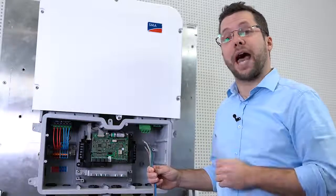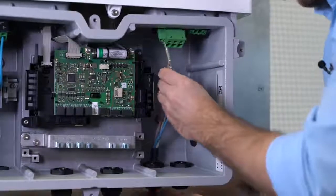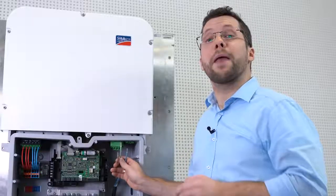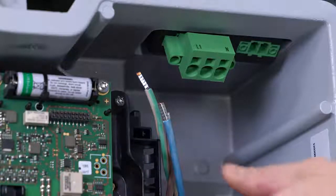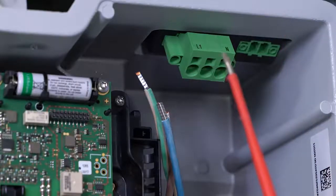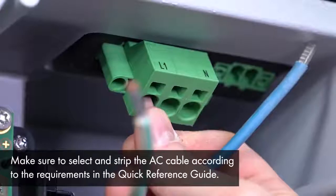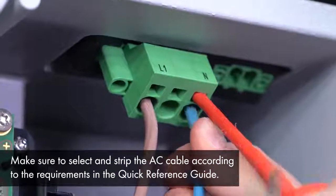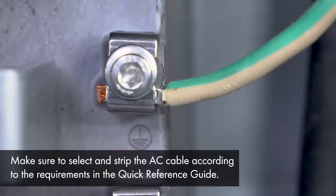Now, I am going to insert the AC cable into the cable gland. The AC cables need to be stripped so they can be correctly inserted into the AC terminals. As you can see, we have already prepared this for you. The next step is easier if you connect the AC plug to the inverter first. It should then be tightened with a 3.5 millimeter flathead screwdriver. Now, connect the two AC cables, phase and neutral, to the AC plug. The flathead screwdriver comes in very handy for this also. The grounding cable must be connected separately to an equipment grounding terminal between the washer and the clamping bracket. Then, tighten the screw with a torque screwdriver TX25.